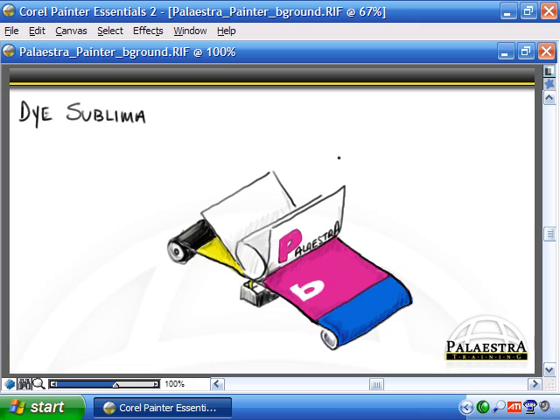Looking at the process in more detail, we have a roll of wax film that has four colors: cyan, magenta, yellow, and black. Each color panel is one page in size. As the page goes across, all four panels run across that page, and the heating element causes the wax to lift off the film onto the page. It applies each color layer in turn, finishing with black. The result is a continuous tone of color that allows for very photorealistic output matching professional or commercial printing quality.